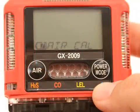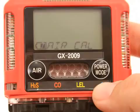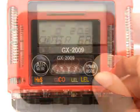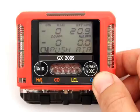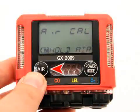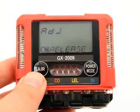Find a fresh air environment — an environment of normal oxygen content, 20.9%, that is free of toxic and combustible gases. When the air cal screen is displayed, press and release the power mode button. A screen appears that displays the current gas readings and prompts you to press the air button by displaying the push air message at the bottom of the screen. Press and hold the air button. The LCD prompts you to continue to hold the air button. Release the air button when the release message is displayed. The unit will take a few seconds to adjust the fresh air readings, then indicate end to the right of the battery icon and return to the air cal screen.